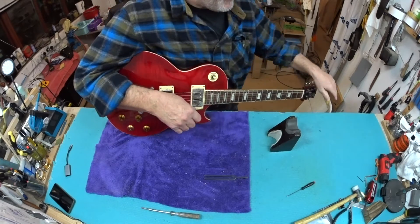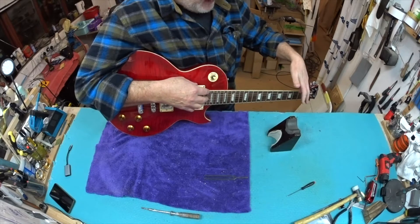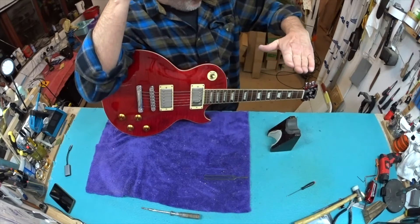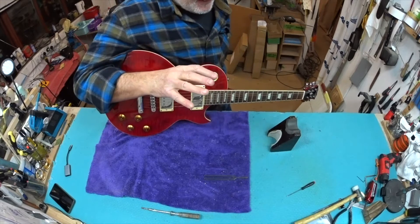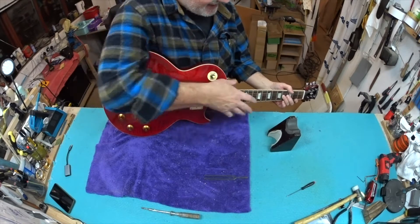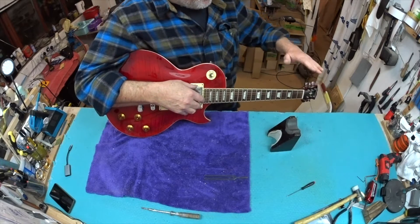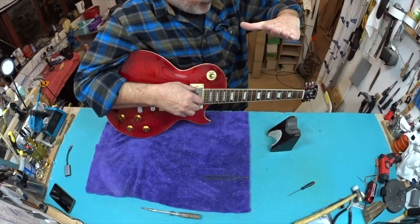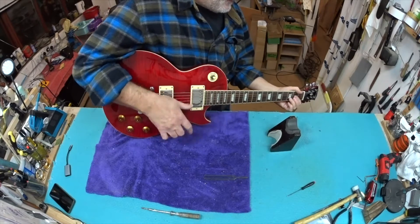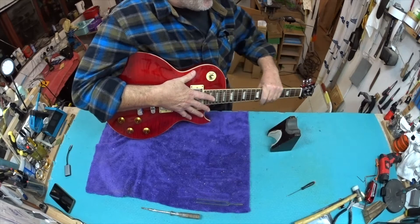What I'd advise on the neck: if your frets will allow it, or if you're going to level them as we are, set your neck as flat as it can reasonably go, but not dead flat and certainly not back-bowed. If it goes back-bowed and then changes over time due to environmental conditions, the minute it starts to go back-bowed you'll lose notes at the lower end because there's a hump in the middle. You have to get comfortable using your truss rod to adjust the inevitable environmental changes - this is made of wood and it's going to move depending on climate.